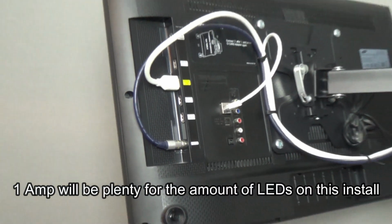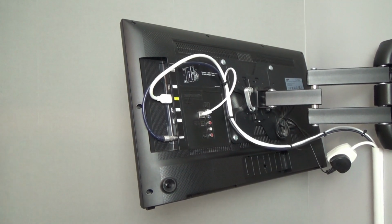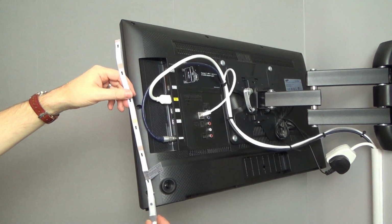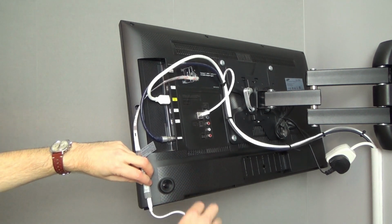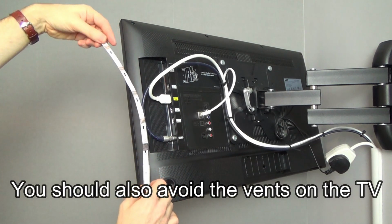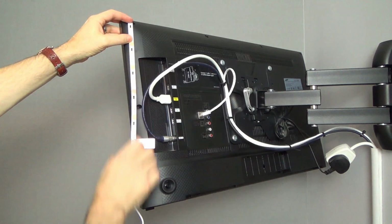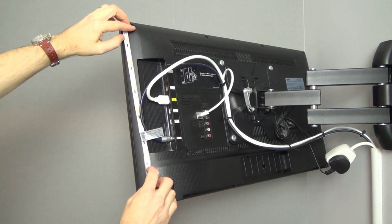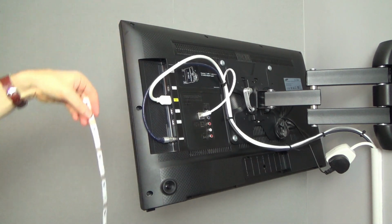Now, although I've got these special little edge connectors, I still haven't got the flexibility of exactly where I want to put it, because, for example, I don't want this thing hanging out the bottom here. They recommend you have it hanging out the bottom because this is what picks up the remote control. But I don't want this big loop of cable hanging out the bottom, so I'm going to have to put it upwards. So I don't have a tight bend on this, I can't have this exactly where I want it, because remember, it's every 5 centimetres or so. So I'm going to be cutting this one here, and this is going to be higher up, and then by the time I allow the corner bracket on, it should allow me to put it on there. So let's get this cut and let's get the corner bracket on.